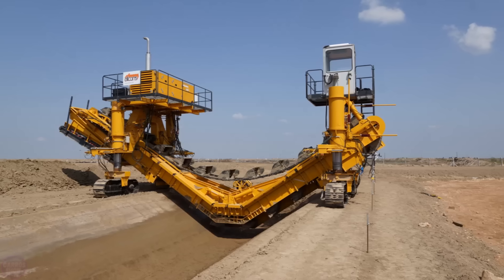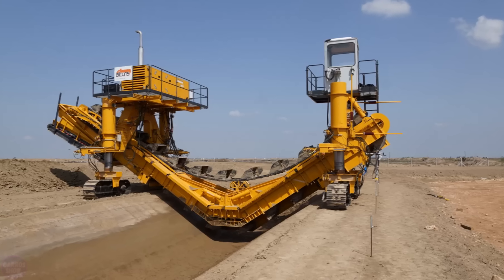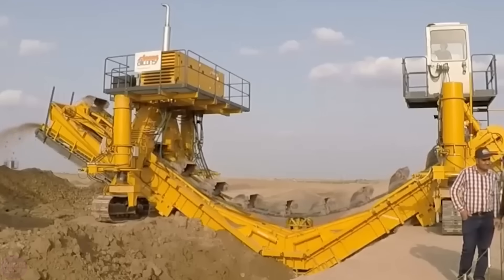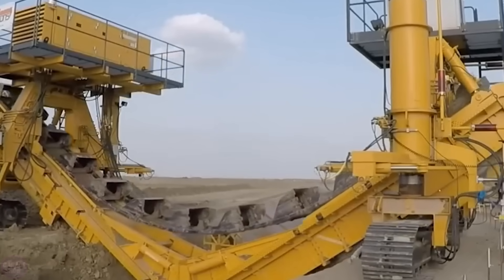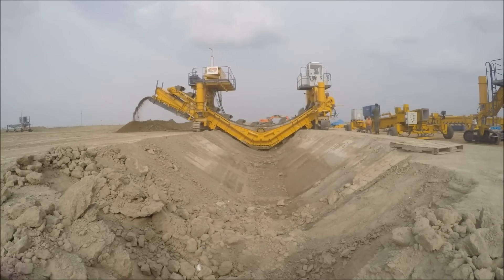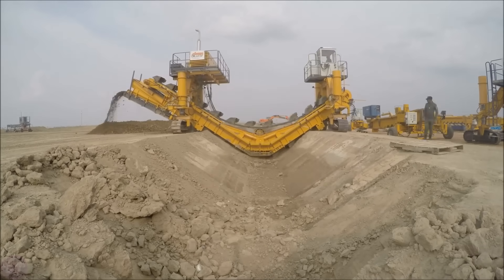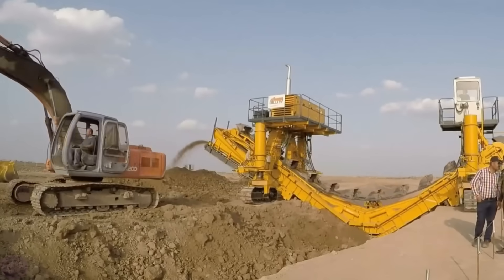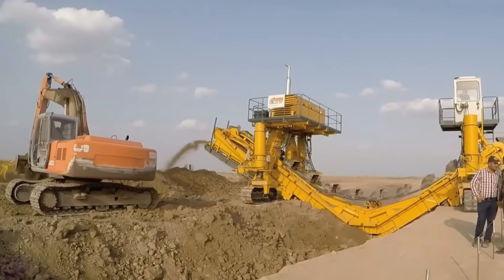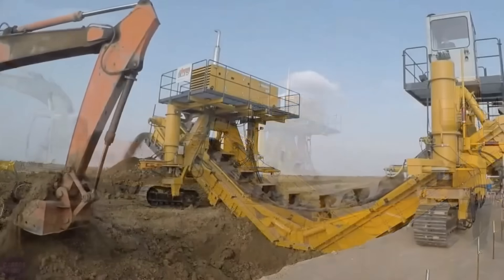With a power of 300 horsepower, it can excavate from 100 to 180 cubic meters of soil per hour — work efficiency depends on the strength of the soil surface. The digging depth is three meters in a single pass. The operating speed varies from zero to seven meters per minute, and in transport mode the equipment accelerates up to a maximum of 18 meters per minute. The buckets have interchangeable teeth, significantly extending the machine's service life.